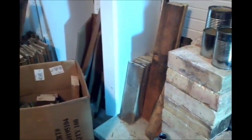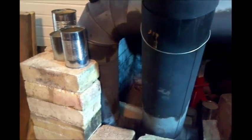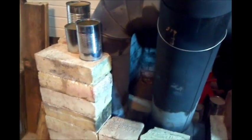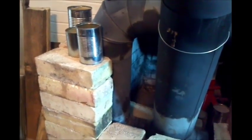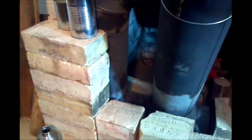The room is 72 degrees — my wife says that's cold, she likes it blazing hot. All this fire brick is holding heat. I don't know exactly what time the stove went out, but throughout the day the loads I've been putting in with the types of wood have been lasting an hour, sometimes a little longer, which means the stove has been out for over two hours. The house is still 72 degrees — I'd say that's pretty good. I need more fire brick. I need to go behind this heat riser with another stack of brick, and that'll give me even more mass. Thermal mass is the answer — you just need a lot more thermal mass.